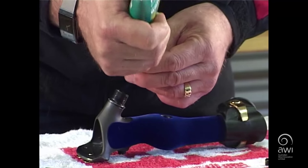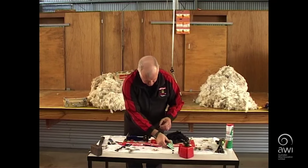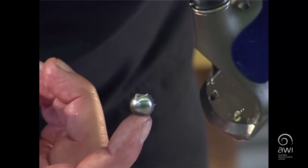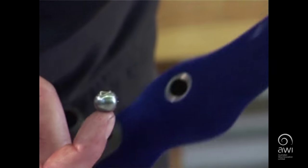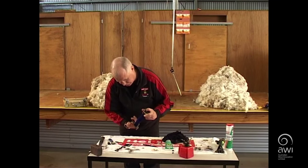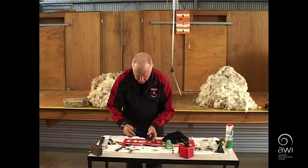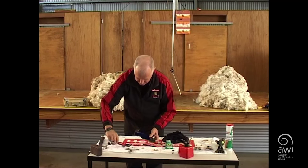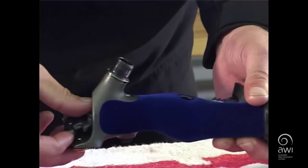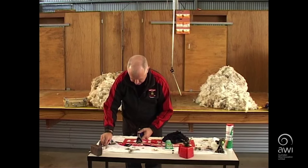Put a small amount of grease into each end of the ball. Sit the ball on your finger with the flat side up. The ball has a flat and a sharp side — the flat side faces the cogs. Slide the barrel over your finger. With the crank pin towards you, put the crank pin into the ball. With the ball turned on the bottom of the barrel, fit the fork into the barrel and over the ball. Replace the fork safety screw.